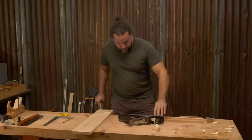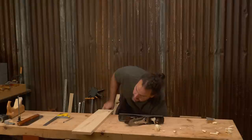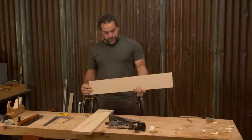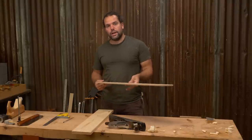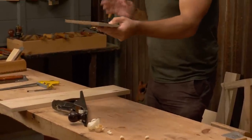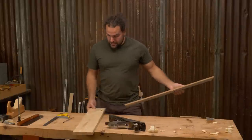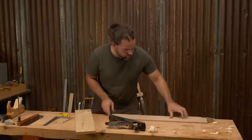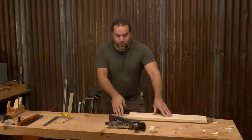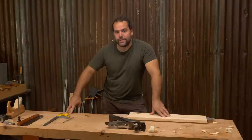If you didn't want to do it with rough and ready sticks — I'd use those because they're normally under the bench — if you wanted to make something proper, a bit of man-made material is your best job because it's even in thickness and very flat top and bottom. A bit of ply or MDF — you could even use a pine board if you had to. You do the same thing: drop it down, throw your work on, but this time because you're not limited to your twist stick length, you can get the full length of the bench if you needed to.